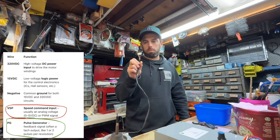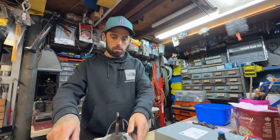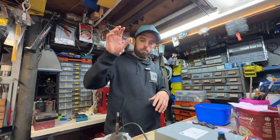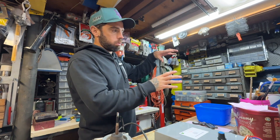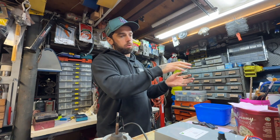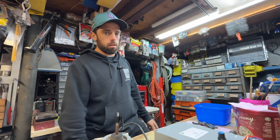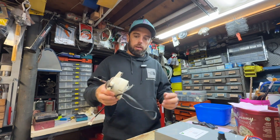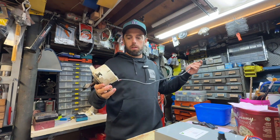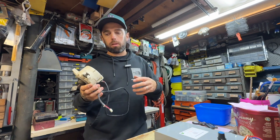When you get an error on any brand — let's say a Daikin E5 error — that means it's a fan motor error, so it's either the fan motor or the printed circuit board. You can go to the board with your multimeter and test it: yeah, it's got 320 volts supplying out of the board, it's got 15 volts supplying out of the board — sweet, it's not the board. But the hard thing is you might have a fan motor that literally spins, everything looks good, and you don't know if it actually works.